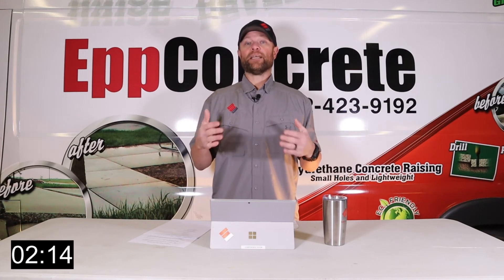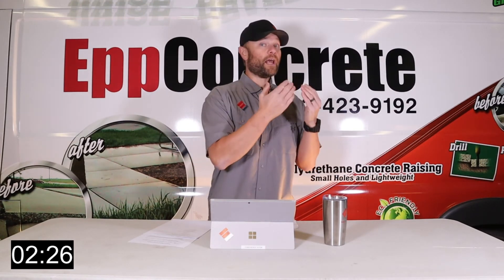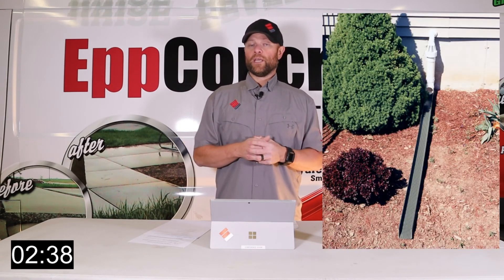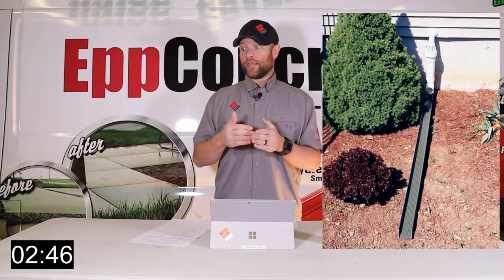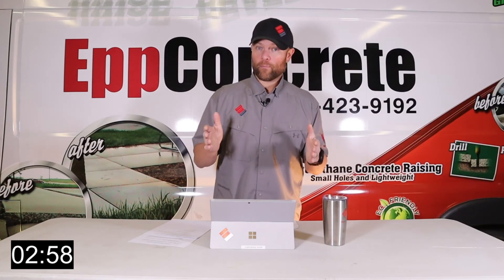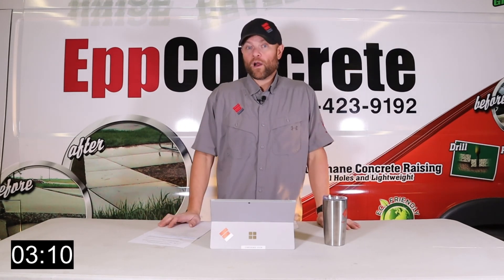Third and last but not least is yard drainage. Yard drainage kind of stands by itself, but we always recommend tying it together with either an interior or exterior drain tile system. Yard drainage is just a good thing to have on a home. What do I mean by yard drainage? Your downspouts are far enough away from your home — you've got long enough gutters and downspouts to get the water away from the home. The general rule of thumb is to try to get the water at least 8 to 10 feet away from your home. But understand one thing: just by getting water away from your home, if you have a leak, that doesn't stop that leak. I hope that answered all your questions on what are the three big methods of waterproofing a home.